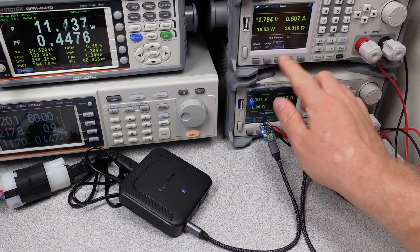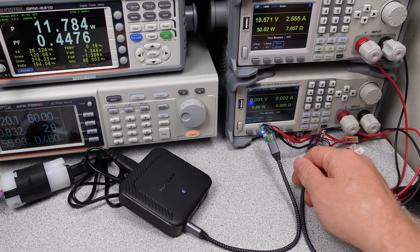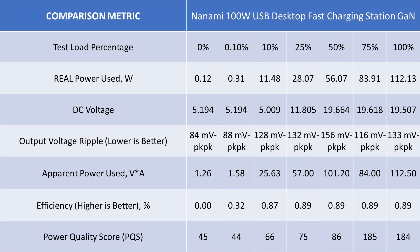The data on this one is okay. In a time when many of these adapters can hit 90-plus percent efficiency, this power adapter is stuck around the high 80s. It isn't awful as a standalone, but in comparison with the devices from later on, it will stand out. The output voltages all look good though. One interesting note is that when the mode of operation changes between 50 and 75 percent load, the voltage ripple on the device decreases significantly, pointing to another reason to have the technology we'll talk about a little later in this video.